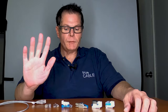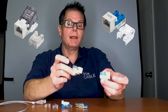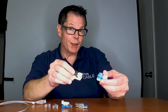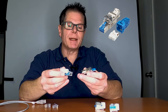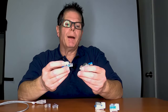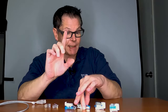The best way of terminating an Ethernet cable — we've got keystone jacks, punch-down and tool-less, although they terminate differently. The printed circuit boards inside are the same and they give you the same performance, although the way they wire up is different. Then we have field termination plugs. These are essentially kind of like a tool-less keystone jack with an identity disorder. It ends up being an RJ45 plug on the end of it and it has a printed circuit board inside. These things are actually quite useful and can give you the best performance when you least expect it.